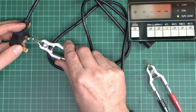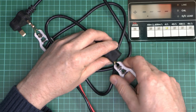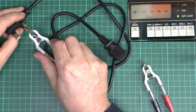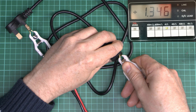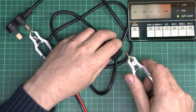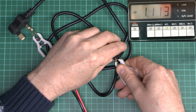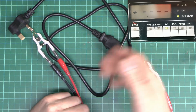Let's check on the line conductor — 1.110 ohms, well over 1 ohm. And the neutral: 1.345. So aside from the fact that these gigantic values are completely unacceptable, they're not even consistent between conductors — 1.345 for neutral and 1.111 for line. Inconsistent values means there's no quality of manufacture there whatsoever, and of course these values are much too high.